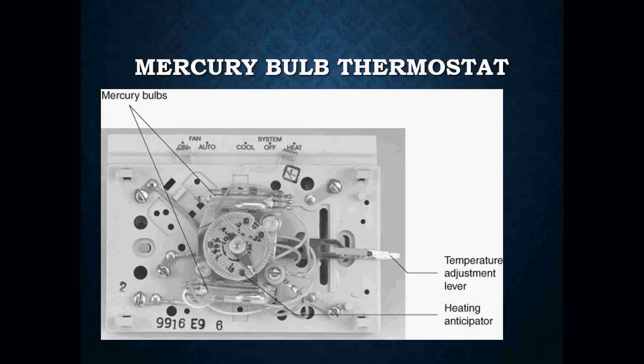If we wanted to go to cooling, we had to switch the thermostat to cooling and then make the adjustments to where we wanted the temperature to be. Here is what a mercury thermostat subbase looks like. This is a heating and cooling mercury-style thermostat. Up here would be our heating connection, this would be our cooling connection, and here is our heat anticipator — basically a slight little heater that would heat up just slightly to prematurely open the mercury contacts, shutting off the furnace so that we didn't drastically overshoot.